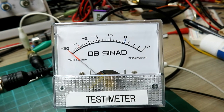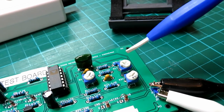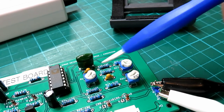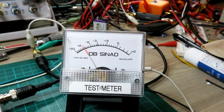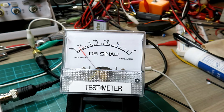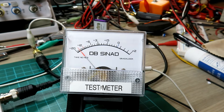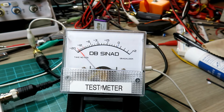Now go back to the FG100 and put it on a one kilohertz tone and run that. This is where you adjust the other controls on the board. The other two parts you adjust are R14 and R17. Between these two you're looking to drive the needle on the meter down to the minimum deflection you can. On R14 you can see we've managed to dip it down a little bit, then we go to R17 — that's got lower — then we go back to R14. This can be quite tricky to do.